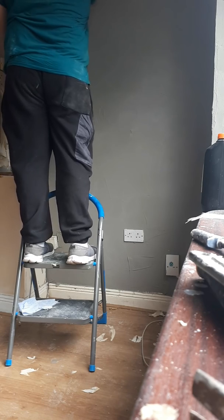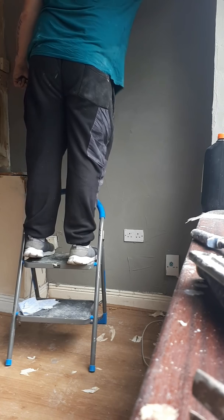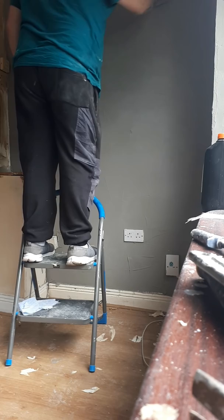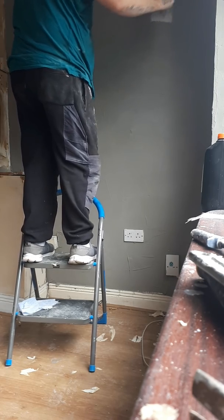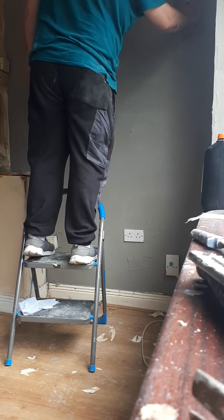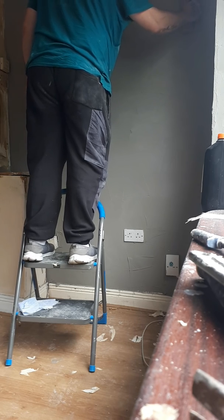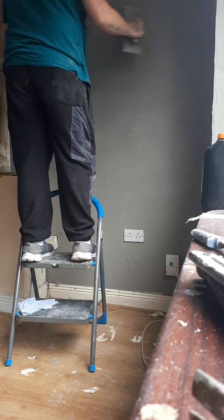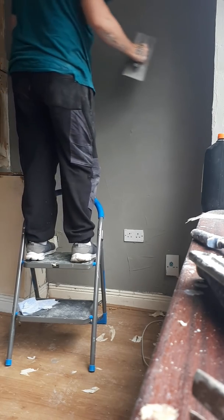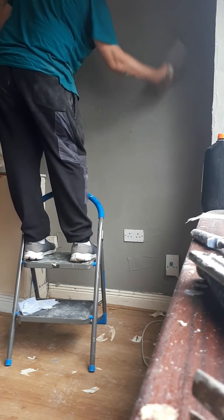And then, this time, we will have to trowel again about 1/4 inch off the wall. This time we're going to put a lot more pressure on it. So a little trick is, if you haven't built up the strength to do it with just your forearm, lean against the trowel and then tilt your body forward and pull it across, and just use your body weight, which in my case is a considerable weight. Just lean into it with your body and let your body do it. That way you don't have to strengthen your arm.